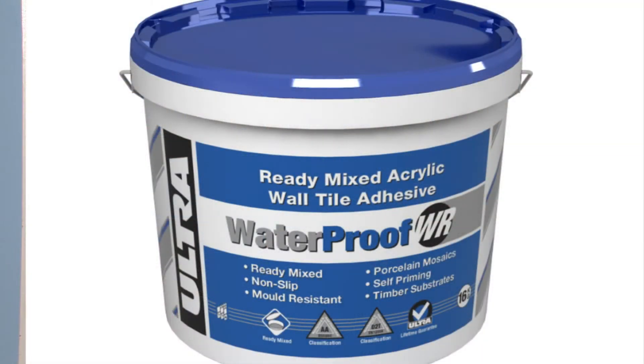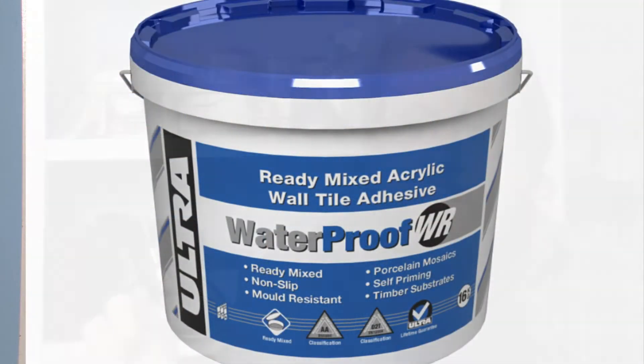You're probably going to want to get a steamer to get the old adhesive off. And once you've got a good clean surface, make sure that when you apply your adhesive you use a notched trowel and apply your adhesive at about a sixty degree angle from the trowel to the wall. Get a good even distribution of the adhesive. Place your tile in there and use spacers to keep a nice consistent space from one tile to the next.